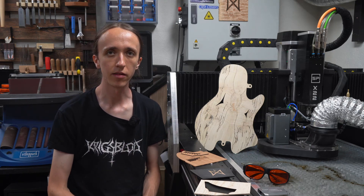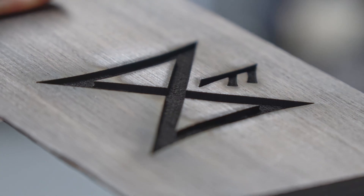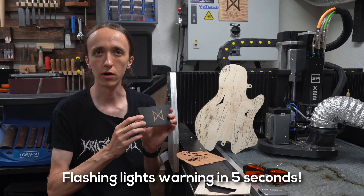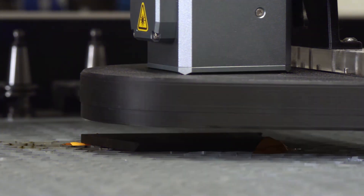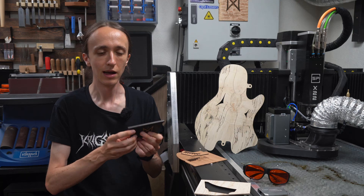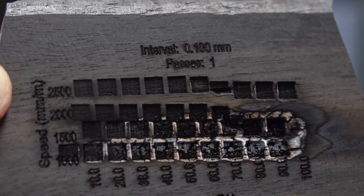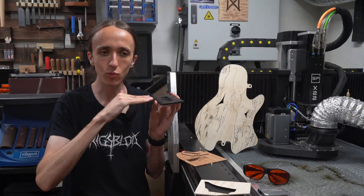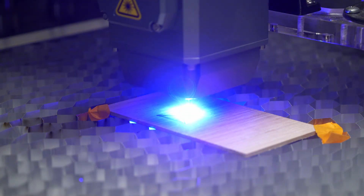What you can also do really well with this is some deeper engravings — not just marking the surface layer, but actually cutting material away. One area where this is really interesting to me is for inlay. I've done a little bit of a test here on ebony. I had no luck whatsoever cutting even very thin ebony on my previous laser cutters, but this one has no problem. This is a very dense wood, and while it is dark so it absorbs a lot of light, it takes a lot of power to properly cut it — but here that was not an issue at all. I was able to do some quite deep engravings.